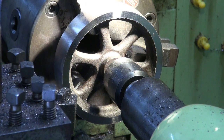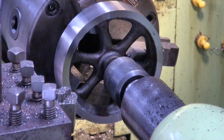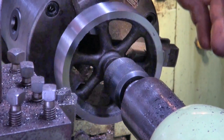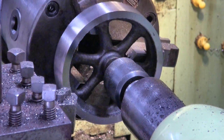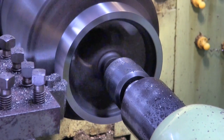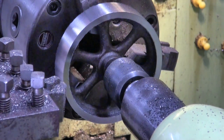91.97 — let's work out what that is in American inches. The drawing shows three and nine sixteenths of an inch, so let's work out what that is. We're looking at 90.48 millimeters for that outer diameter, so I'm going to set my caliper to that. I've got about 1.46 to 1.48 millimeters to come off. That should be the outer diameter done now.